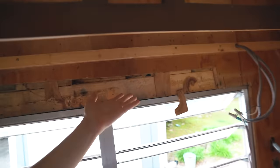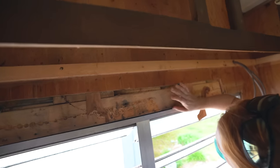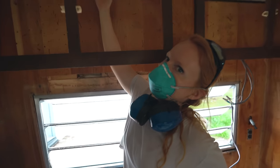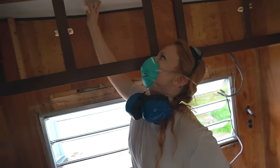So this is what's behind the wall. We really thought this was going to be all rotted out like the sleeping area was, but it's really not — there's just a couple little spots of mold there and then a little bit of surface stuff. This could all probably have a layer of Kilz put on it and then be sealed back up, I would think — although it makes me wonder what's going on with the roof, and the roof is not something we really want to mess with, but not yet anyway.